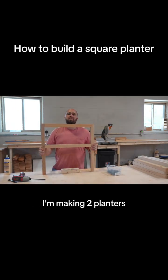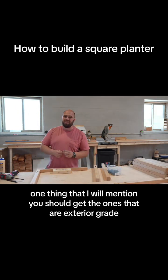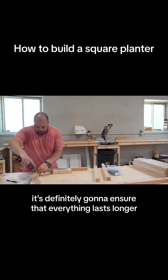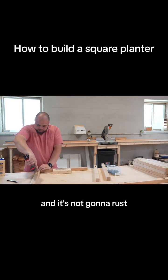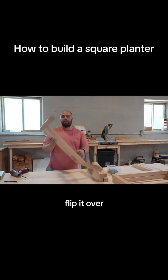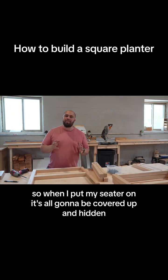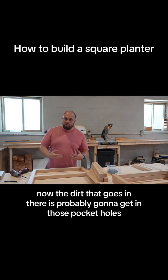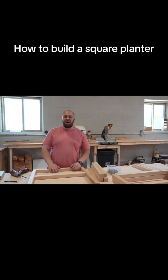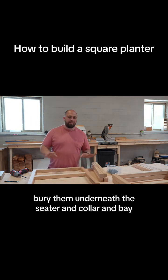This is the first frame — I'm making two planters so I'm going to have four of these. With the pocket screws, one thing I'll mention: you should get the ones that are exterior grade, especially since these planters will be outside. That will ensure everything lasts longer and won't rust. Now that I have my four frames put together, I'm going to take the pocket screw side, flip it over so it faces the outside of the planter. When I put the cedar on, it'll all be covered and hidden. If you have them on the inside, dirt is more likely to get into those pocket holes, creating more chance for mold and mildew. From an appearance standpoint it also just doesn't look as good — I'd rather hide them under cedar.